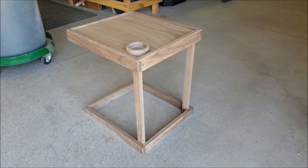Anyway, the reason for all of the holes that you see, I use finished head screws, and I'm not a fan of putty. So what I do is I finish it, and then I go over it with a matching crayon pencil, a special pencil that fills in the holes. You can't see them, and you don't end up with a little bleached ring around all of your putty holes that you would normally have with a conventional wood putty. And I can get a much better match with the crayon pencils than you can with the putty because, of course, they make maple and they make walnut, but they don't make light walnut and dark walnut and light maple and darker maple for the areas in the maple that have a lot of mineral deposits in it, and that's a little darker, and walnut's too dark, so you know what I mean.